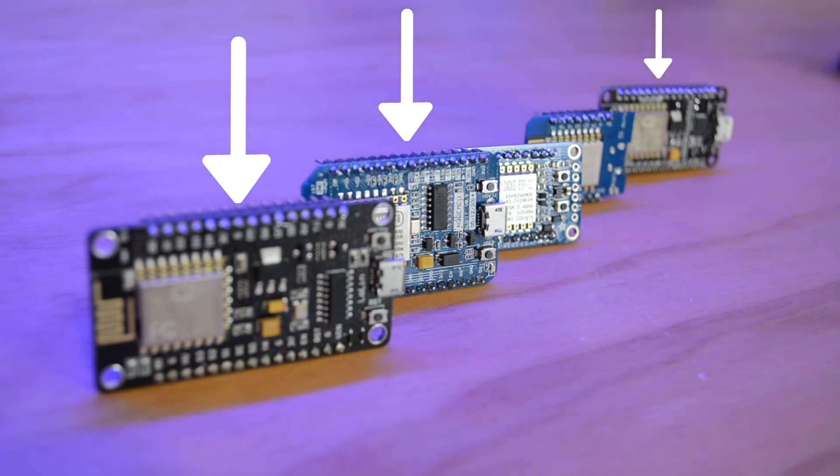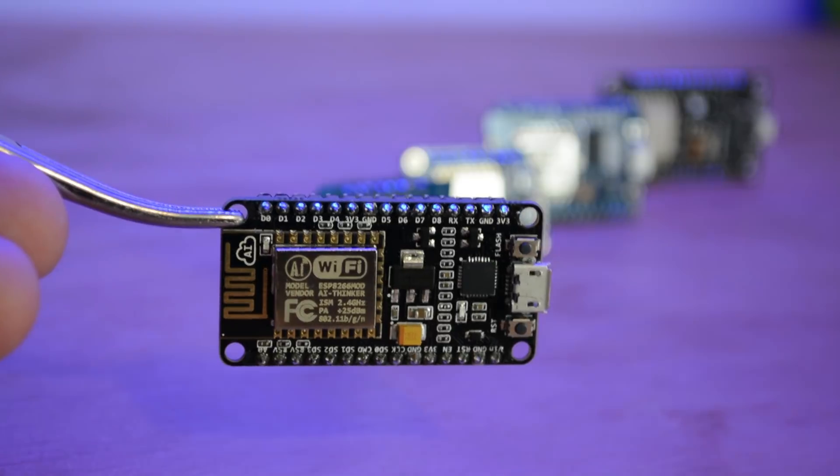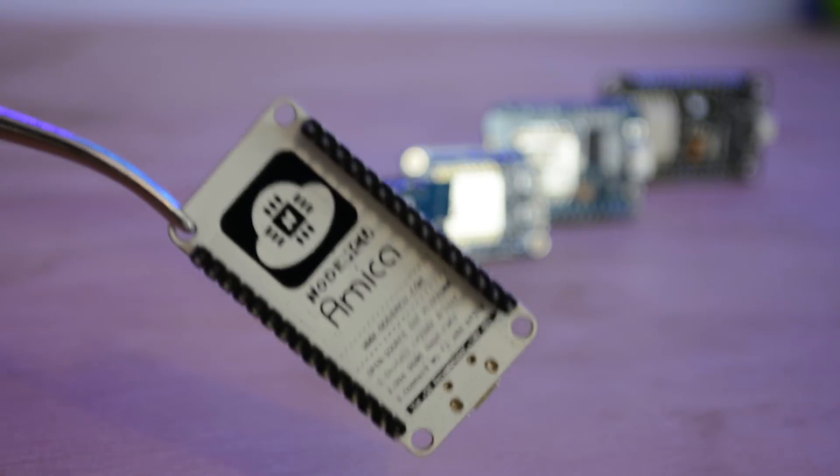In the process of making this multi-sensor, I tested a lot of the all-in-one ESP8266 microcontrollers. I tested the NodeMCU and all of the variants I could find, the Adafruit Huzzah, and the Wemo D1 Mini. While all of those worked, I landed on the NodeMCU 1.0 because it's readily available, really cheap, has an integrated USB port, and has all of the pins I need. I can connect all of the sensor module pins directly to the NodeMCU board using just header wires — no soldering, no splicing.